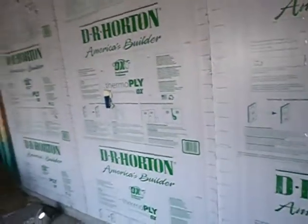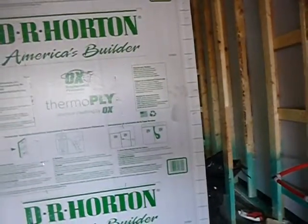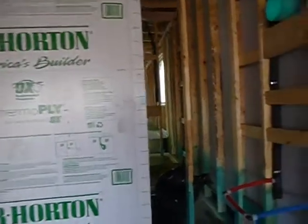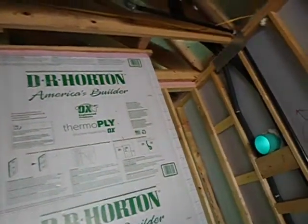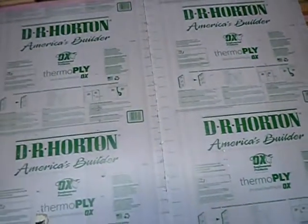See this panel? It's not required on all the interior walls, just the shear walls. The engineers designed this structure so the house can withstand a certain amount of lateral wind force and seismic activity as well. So what we've got here is 3 panels. Is that enough? Is that what's drawn on paper? We got 2 for the laundry and 3 in the garage on the south interior walls. And so this is a shear wall. My understanding is that most likely it's required to have the panels. But I didn't draw this. I'm not an engineer. So we want to have some discussion with the builder about that.